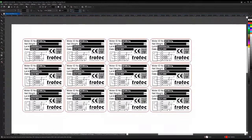If you're going to make a template, this is how I would make a template or fixture or jig with your laser system. If I want it to be right up to itself, and I would say this object was 3 inches and I duplicate it at exactly 3 inches, when I duplicate it, it's going to put that line right over the top. So if I was engraving, say, anodized aluminum tags and I was not going to cut this, I could butt the samples in your laser system right up against itself, and then it would engrave on each one of those tags across the field.